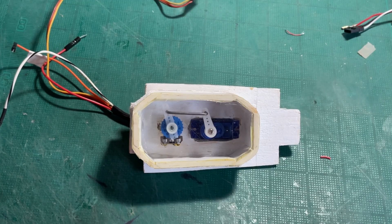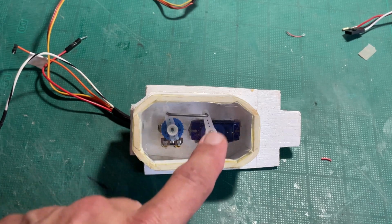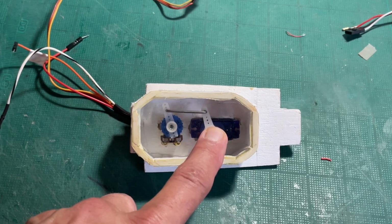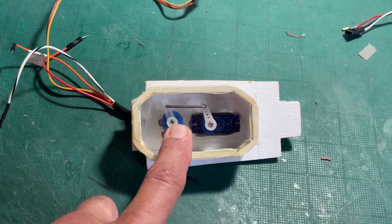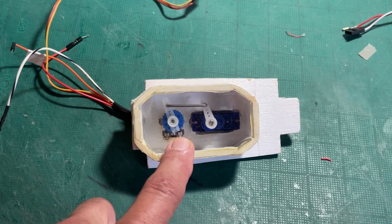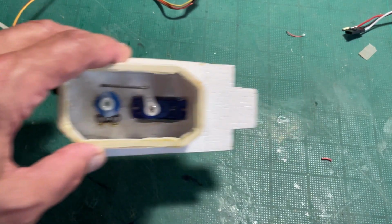Another improvement I made was when I originally tested the boat, I was unable to read the throttle position from my remote control receiver. So what I did was I made this little servo that was attached to a potentiometer, and I attached that servo to the throttle joystick. So when I moved that, it basically changed this potentiometer, and I had the Arduino read the potentiometer. Turns out it's super easy to plug the output of your receiver directly into the Arduino and figure out what the pulse width is. That's just like one line of code. So this entire unit got dropped out.